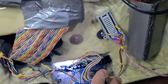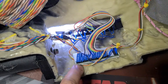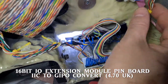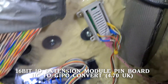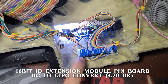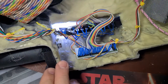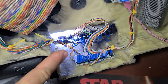The Raspberry Pi is driving, via all these wiring looms, a device called a 16-bit IO port expander. It sounds very complicated, but all it's doing is — we've only got a few wires coming out of the Raspberry Pi, yet it's driving all these LEDs. The port expander lets the Raspberry Pi tell it which pins to switch on and off, and it expands just one or two wires into a big array — 16 wires in this case — which is enough to drive all these LEDs.